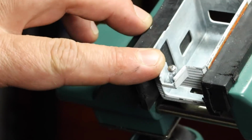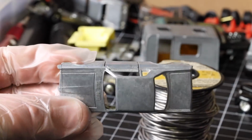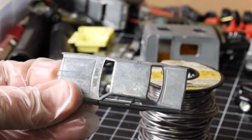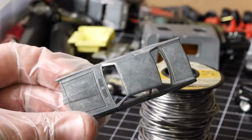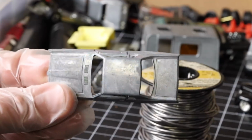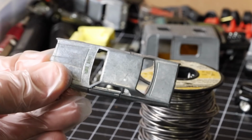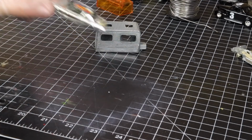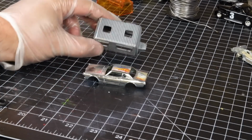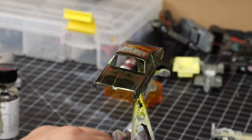Now we went ahead and stripped the paint off. This is a Matchbox. They're quite a bit rougher than Hot Wheels, at least in my experience. So I went ahead and tried my hand at Zinc Electroplating. I had a lot of subscribers comment about that. Now this is not with the Zinc Electroplating here, this is just the bare metal, but I did do it off camera. And in my experience, if you've got pitting like we do here, especially on the hood, the Zinc Electroplating is not going to do a lot for you. It simply just adds a coating. Does not fill in pits or anything like that. But I will tell you this, it polished up really nice.